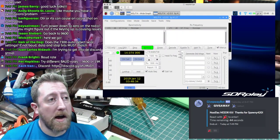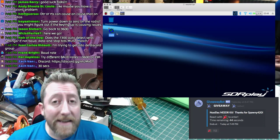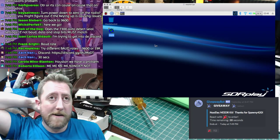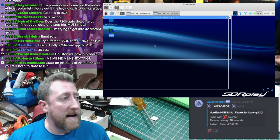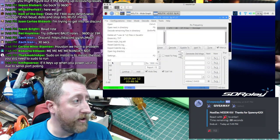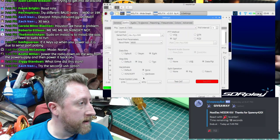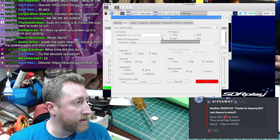Well, I went into this blind, so I didn't expect it. Well, actually, I take that back. I did expect this to work because I have literally run WSJTX on every platform. I've run it on Ubuntu, Mac, Windows. Maybe that's not every platform. This is the first time running it on Raspbian though, which is still Linux, but. Not behaving. This is identical settings, by the way. Mode. None. You usually leave DTR and RTS empty. It's on cat. It's supposed to be.